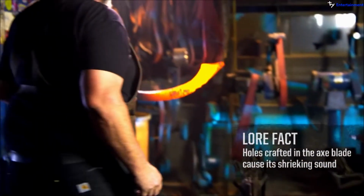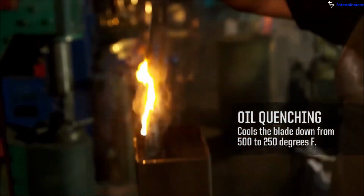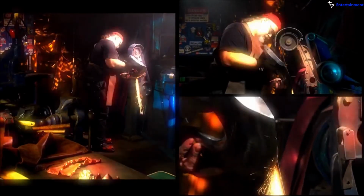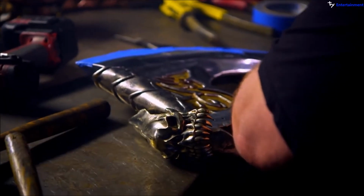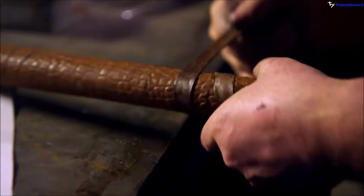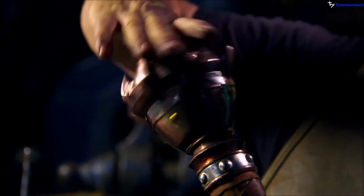So I made the cutting edge, heat treated it, tempered it. All right, cool. And welded it. Now razor sharpened it. So I'm happy with this. This can go out. I still need to attach the skull from the inside with the handle. I'll put the base leather over the top and then in turn cover that with strips of crisscross leather. And then at the bottom of the leather-wrapped oak handle is a copper and nickel-plated butt cap or the butt spike.